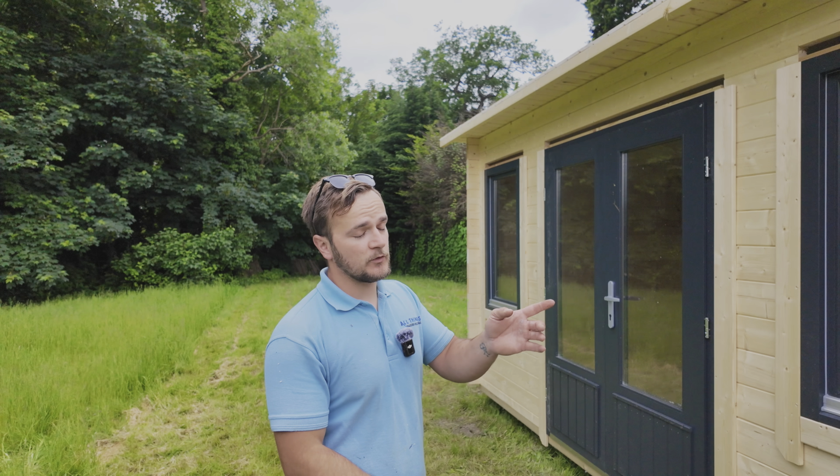They are 70mm wide. We need to make sure we leave a little bit of wiggle room on these. If I go over it, little pencil mark, again, I've left myself a few mil. Ruler, cool tool to have in your pocket. But I know we are 70 mil wide, so let's put a little pencil mark, 70 mil, and then what I'm going to do is come back 5 mil, because I don't know whether you noticed, but on the roof joists, it comes in 5 mil, and that is where my cut line is going to be. And then I'm going to come down the full depth of the joist, which is 210mm, and do something somebody else was supposed to do. So let's get that solved so we can move on.